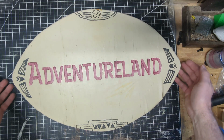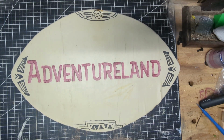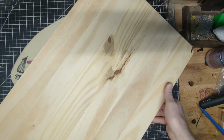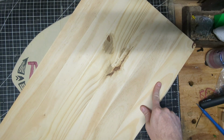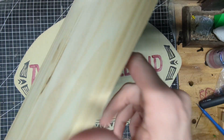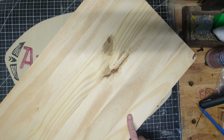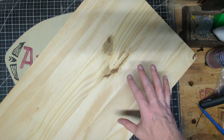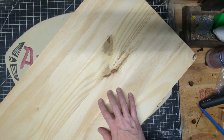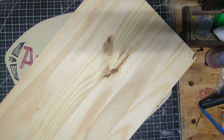So what I went and did was go to a hardware store. The big hardware stores will sell you already pre-edge glued pieces, not unlike the project panels of plywood, but it's actually edge glued solid wood as opposed to laminate, so it's not going to delaminate like the other one here did. So what I'm going to do is take one of these and lay this on top just to do the outline, because I am actually happy with the shape in general.